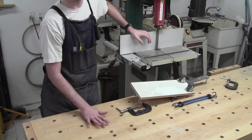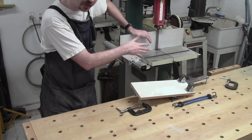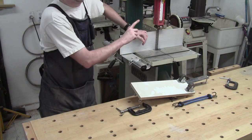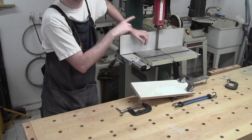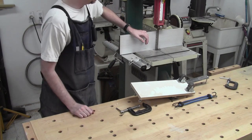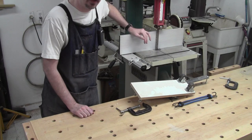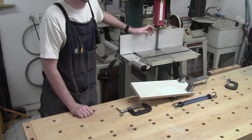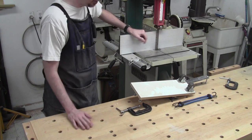Get predictable, repeatable, confident results. I love a flat fence. I don't like a pivot fence or a point fence. I refuse to acknowledge that bandsaw drift has to be compensated for — I take it out. There is no drift in my saw. I don't accept drift and I won't angle my fence to compensate for it. I will make it flat. That way when I put a new blade on and make it flat, the fence doesn't have to move. Works great. Got a little ranty there.